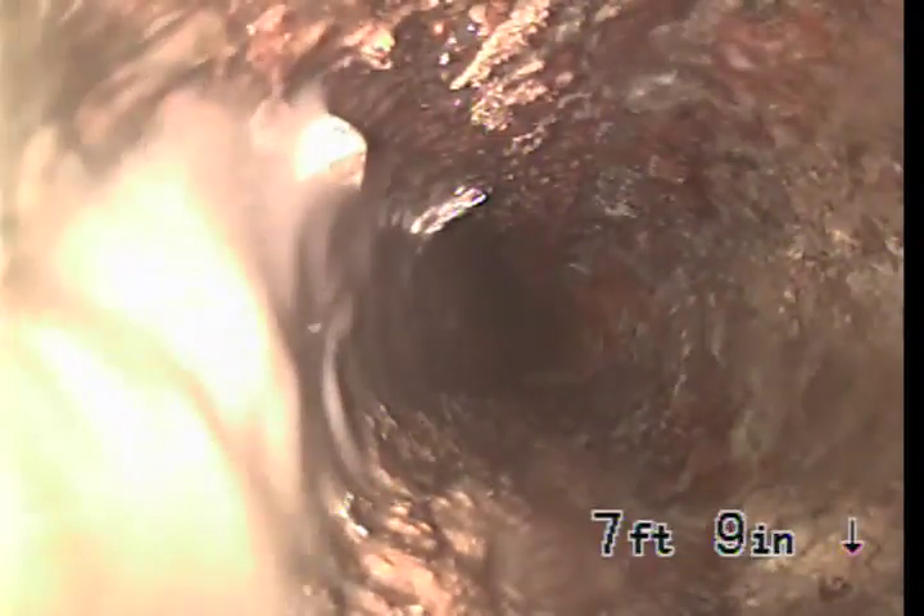See right here, we kind of go under water. There was a little bit of a blockage. Now we're in a 4-inch cast iron. Now we're underneath the home, and we accessed this pipe by disconnecting a small pipe that we're going to put back together — it's just a no-hub coupling. We're recommending to install a clean-out underneath the home so we can have better access, and also a hydrojet to remove those roots and re-inspect.